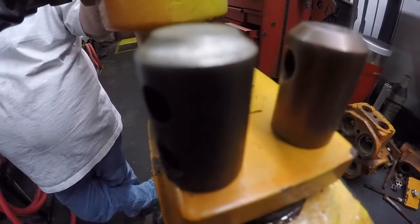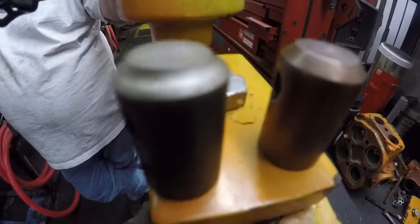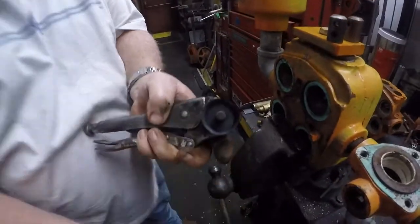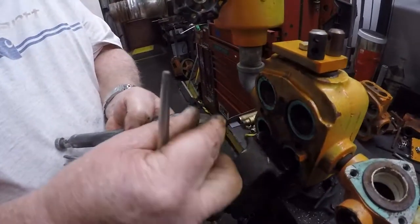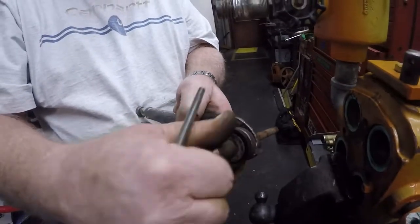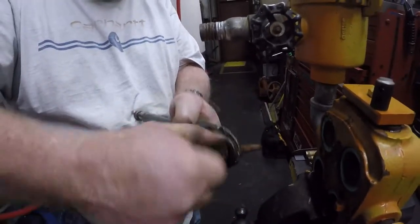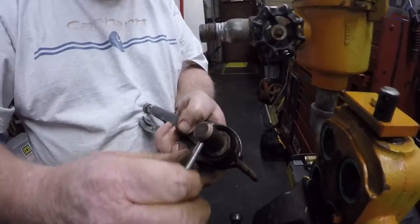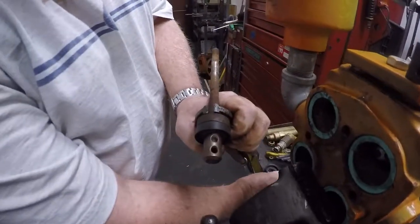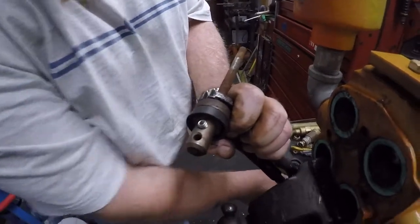Here you have your old valve stem seat — you can see how much it's beveled compared to your new valve stem seat. We're going to go ahead and replace the valve stem seat. We're going to take our packing and place it back on, and then our washer. Replace with the new valve stem seat. When you put that on, it's very important to hand tighten it as tight as you can get it by hand. Then take your punch and don't tighten it more than a quarter of a turn — if you tighten it more than a quarter to a half a turn, it's going to smash your packing down and you'll end up having a leak. Once that's done you can replace your set screw and tighten it back.